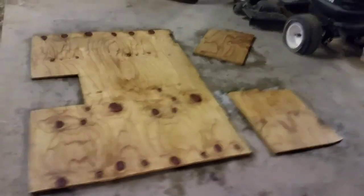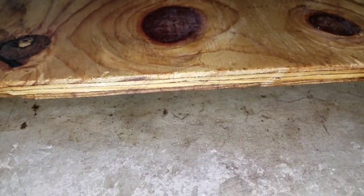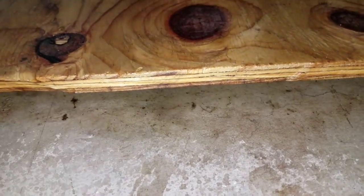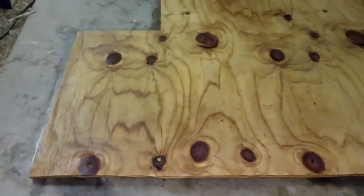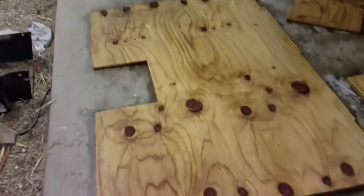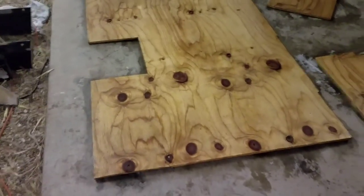It won't really go past that first layer of ply because of the glue, but you can see this is a four-ply plywood so it's a pretty good penetrating coat — at least to help it. It's never going to see UV light so I shouldn't worry too much about it degrading, and even if it does degrade, the deck will still be able to breathe. The idea is just to keep it dry. I'm not going to put any screws in this deck — it's a philosophy I'm going to keep with.